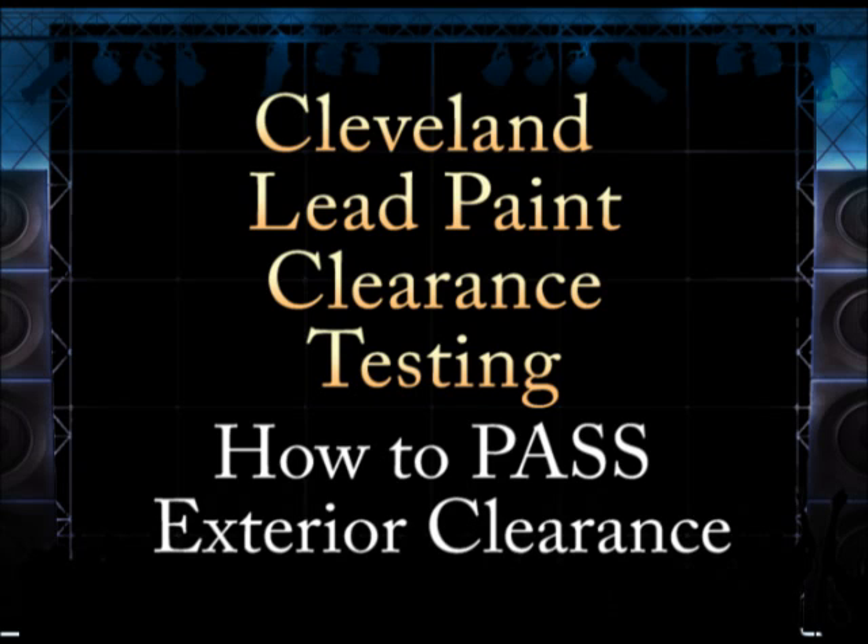The assessor will decide the number of tests needed and where to take the tests. This was a Section 8 home that was cited for peeling paint on the front porch concrete floor and for peeling paint on the back concrete steps. These were the two locations that were sampled. The homeowner was smart and installed indoor-outdoor carpet over the entire front porch area. I tested the front porch entrance area because this is where people enter the home and potentially track in lead dust on their shoes. I also tested the back steps because this is also an area where people track in lead dust.